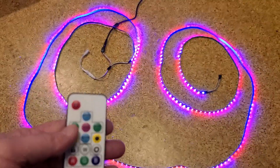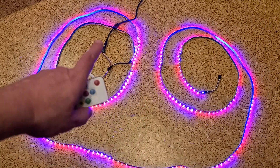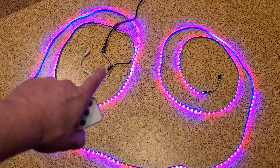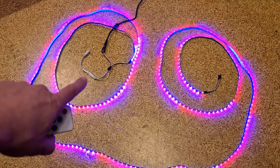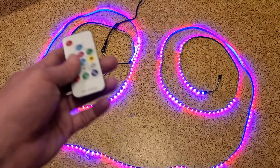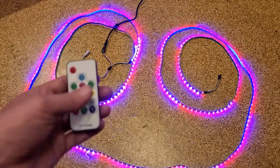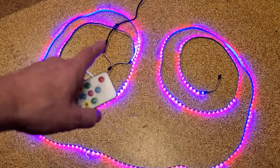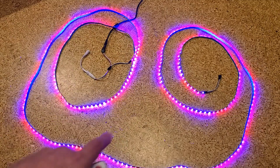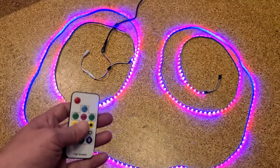One thing I'll mention is that the concentric barrel connectors they come with let you connect the power supply directly to the wires of the LED strip and not run all the way through the controller, because it's a 40-watt strip. The concentric barrels aren't rated for dozens of watts of power, unfortunately. This is a situation where I'm going to end up having to basically solder the wires and make something. Part of the issue with the voltage drop is making another chase wire to go to the other end of a long strip.